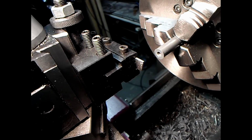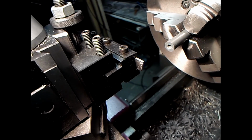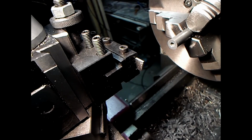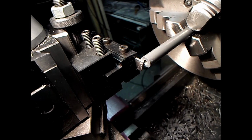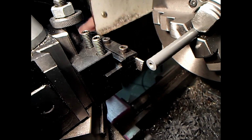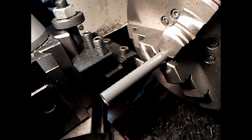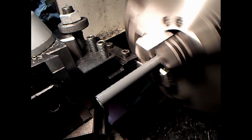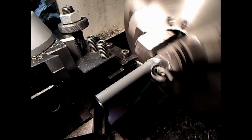I ran it a number of times cutting air, and it would fail. The behavior was erratic. Sometimes it would stop, triggering a shutdown after a minute, 5 minutes, whatever, whenever it felt like it. Sometimes the wrong flash code, and it would not trigger after manually breaking the power to the spindle motor. It had a mind of its own when run under G-code, but for some reason was reliable when hand tested.